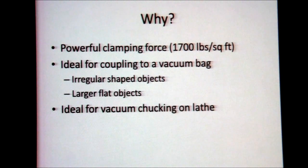That way you can take a bowl or something like that that you've already turned the inside of and made it just absolutely perfect, maybe even got it finished. You can turn the thing over, put it on a rubberized faceplate, and pull this vacuum, and it's on there just as though you had chucked it. Just as though you grabbed the thing with Cole jaws or Longworth jaws.